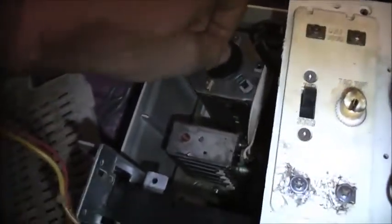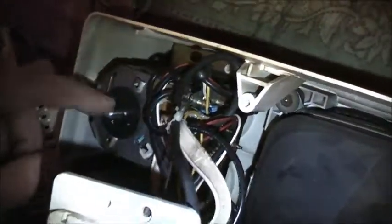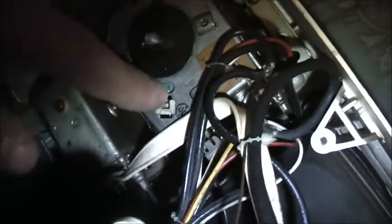1 watt, 8 ohm speaker. Dynamic make. This is the old rotary one with a rotary encoding channel change mechanism. Very hard to find these ones now. It's like a tuning capacitor in a radio. Same with this one. This one has a little row of switches and contacts to select the channel. Very cool how they work. It's a very long CRT too.